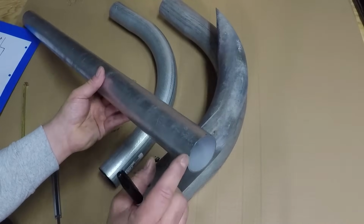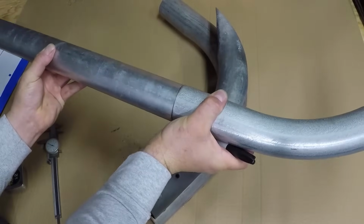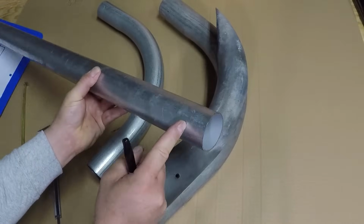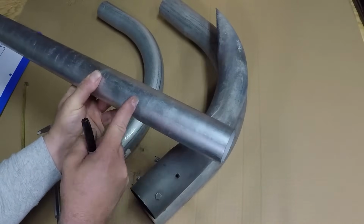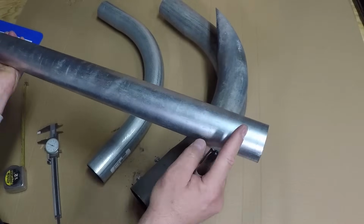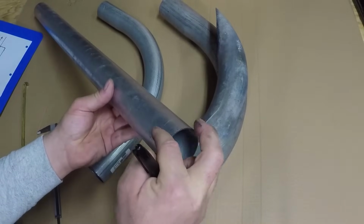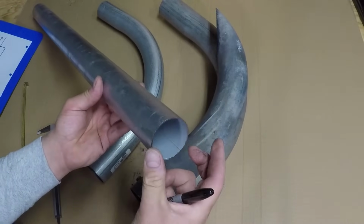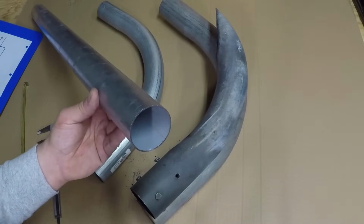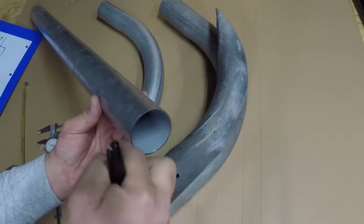The way I'm going to do it: from one end, the top end, where I have to weld the 90 and that's where the end cap is going to go, I'm going to go back 1 inch, and then I'm going to measure 1 inch from the other end. So I will have about a 22 inch section in the middle. And then I need to mark 8 sections, because if you do the math, it's 2 3/16 times pi, which gives you about 6.8, the outside circumference.